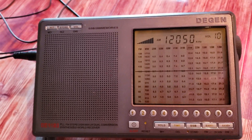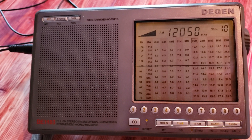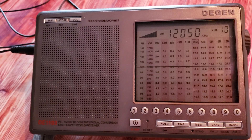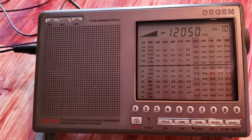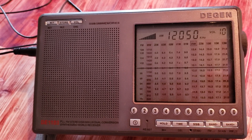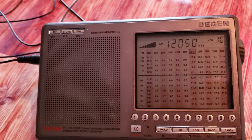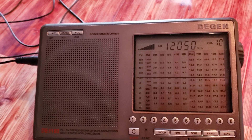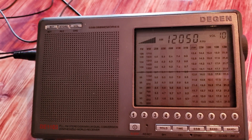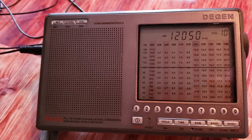It's worse — it's actually worse. The medium wave band is amazing as I showed in another video, but shortwave is either crappy. I've had a few signals that were improved, but more that were degraded, and often not much improvement over the telescopic antenna or the loop. For shortwave, this is not a good antenna — I can't recommend the AN-48X if you're a shortwave listener.